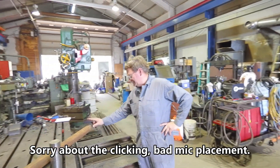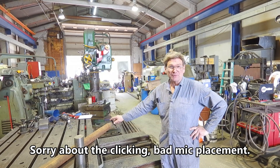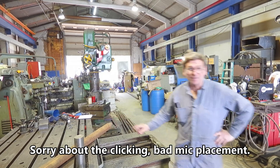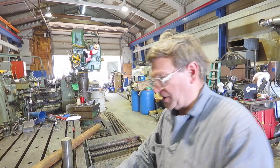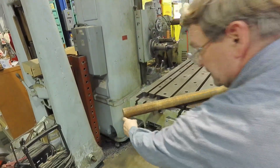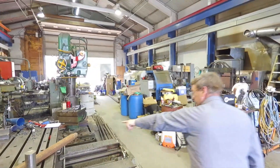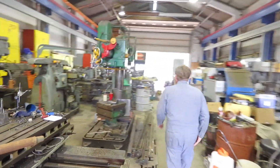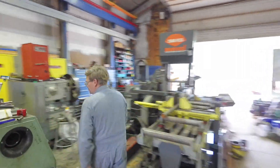What we're cutting here is for a drill rig. We still need to clean this up a little so we can use it as a test piece. We're cutting the box — making an adapter for the people that will be using this box end. We can't use this one of course because this is a piece that they need, so that would be the piece that goes over this male. It has a pretty good taper to it — the taper is two inches per foot on the diameter.